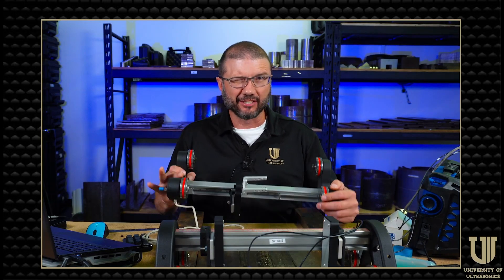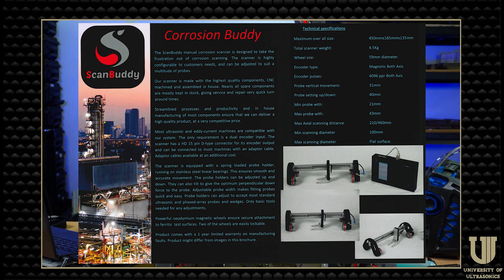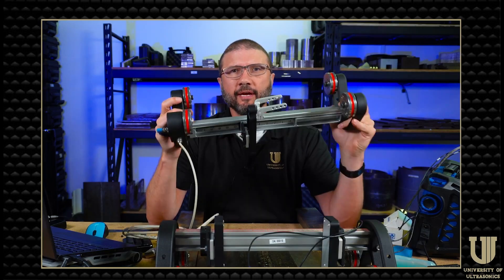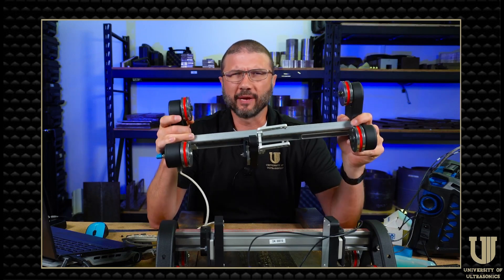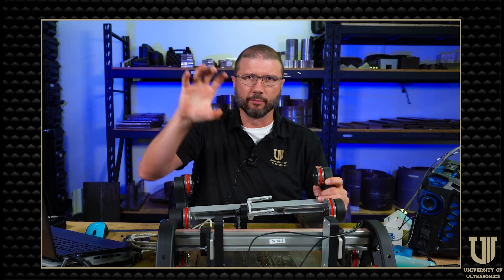What I didn't get a chance to show were the corrosion scanners. This is the Corrosion Buddy — a dual axis semi-automated corrosion mapping scanner, really cool. I haven't had a chance to record with it yet, but I will. They also make another one called the Matrix — it's a pair of string encoders, and when you combine them together you get a paintbrush-style scanner where you can move the probe anywhere and it'll map out your movement.